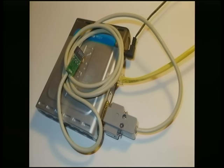So I had all the software ready. All the software does is, on the parallel port, it looks like an I.O. port. So it bit bangs the JTAG stuff through the parallel port. I did the same with the GPIO pins. So all I needed to do was take this apart and find some GPIO pins to use and get the software running on it. The kernel was a little bit broken on this one.